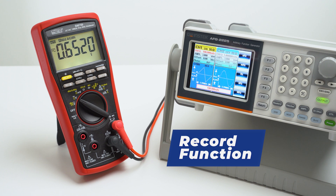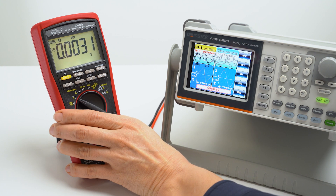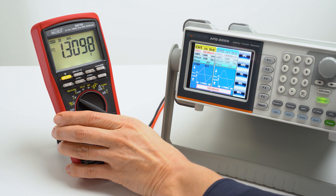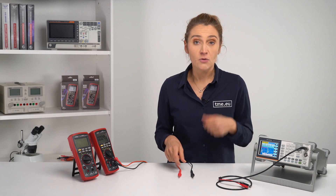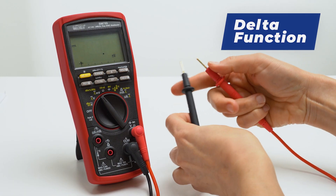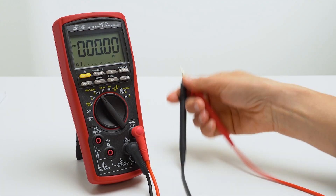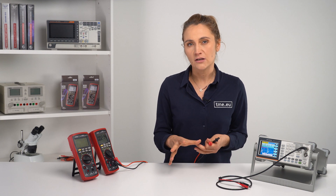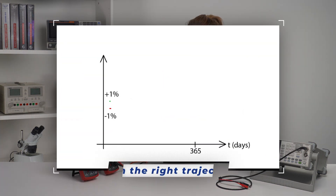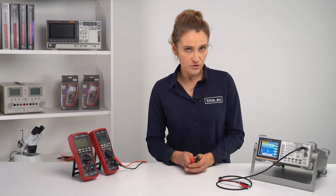But the average is a lie. Each one of us has our own standards, and our average can be the lowest or highest point of someone else's. What you should do is set a relative point for yourself. Here is how you do it with the BM789: if you want to zero the readings, cross the tips and press Delta. If you have other specific values, just probe it and click the triangle. Don't look at others — the most important thing is to be on the right trajectory, just like Brymen with the new Auto Hold feature and the continuity test.